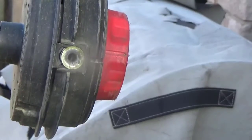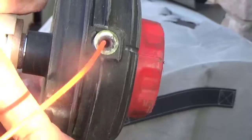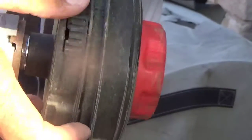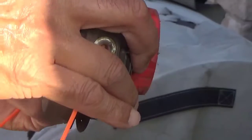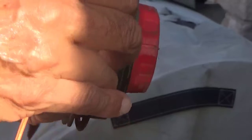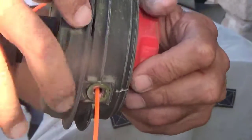So there are the eyelets. You push in around three inches of the trimmer line on each side. It works better if you cut it at about a 30-degree angle — the inserting part. About a 30-degree angle. And then turn the knob, and I'm doing it left-handed here.